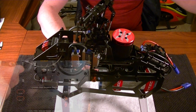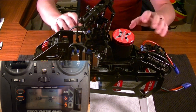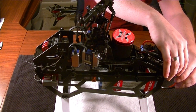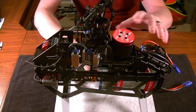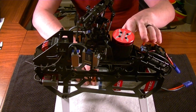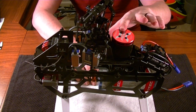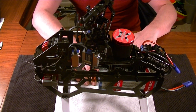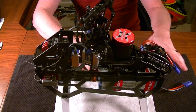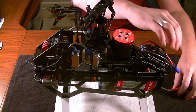I'm going to raise my throttle stick to full and plug in the main pack. What we're supposed to have happen is you'll hear a series of beeps and tones - first it counts the cells, going dee dee dee dee dee dee. What we're looking for is a short three-second pause, then the motor goes beep beep. As soon as you hear those two beeps you're supposed to lower down to zero on your throttle, it'll go beep beep beep, and that tells you the throttle channel is calibrated.